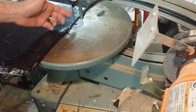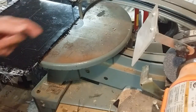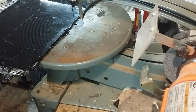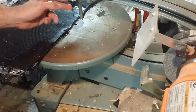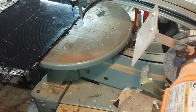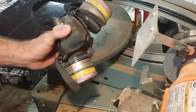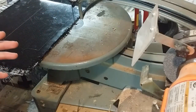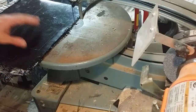The downside to using this is that it will wear out a saw blade after probably about 12 inches of cutting — it's really surprising. Right now I have a 15-tooth-per-inch blade on here. A finer blade makes a much finer cut, which is great, but it wears out really quick. So there's a compromise. I'm going with a coarser blade this time to make it last a little bit longer. When you're cutting this stuff the dust is really bad, so make sure you wear a respirator. On a scroll saw there isn't that much dust, but if you're using a grinder at all you're going to need a respirator — once it gets in your lungs it doesn't go away, so be smart about this.